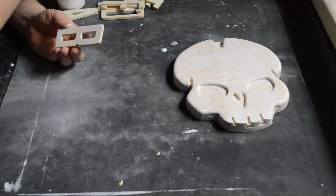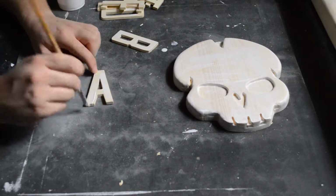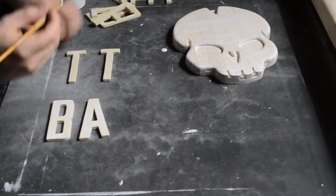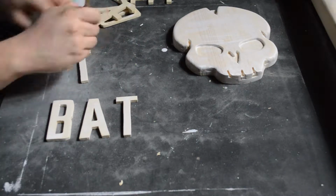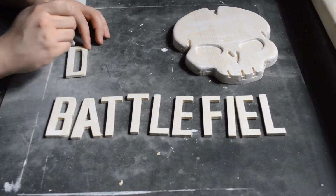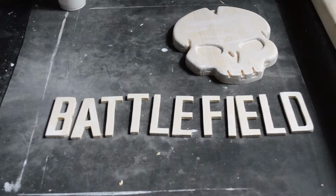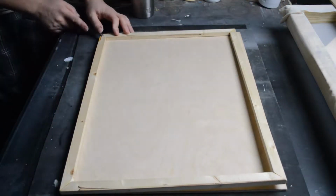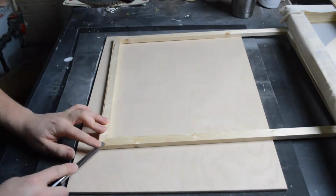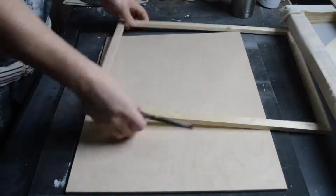This also has the effect of sealing the wood grain, filling the wood grain rather, so that it doesn't look that it has that texture of wood. This stuff, I don't record me mixing it, but what you do is you put it into a plastic cup and you take like a palette knife or something, or a brush or a spoon. I mean, anything would work, but you probably wouldn't want to use a spoon. And you add a little bit of warm water and you mix it, and you want to get it to the consistency of like thin pancake batter. You can make it thicker, but then you have the problem of it keeping the brush strokes in, and then that has to be sanded down.